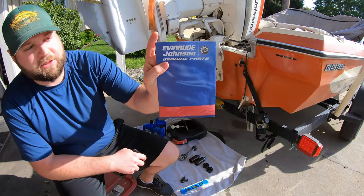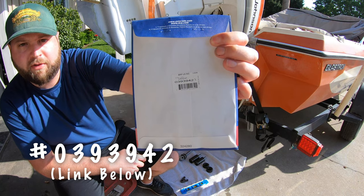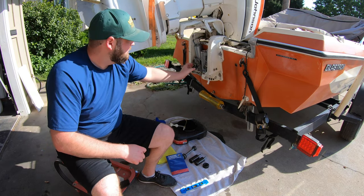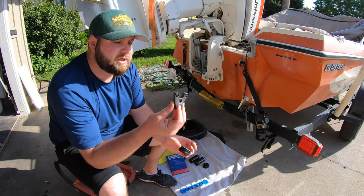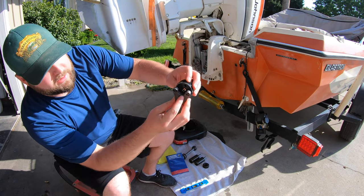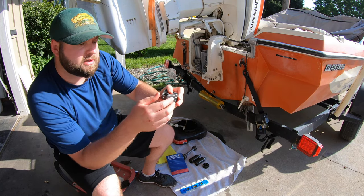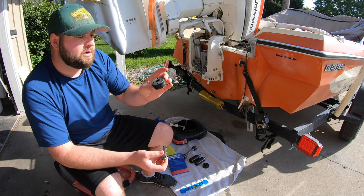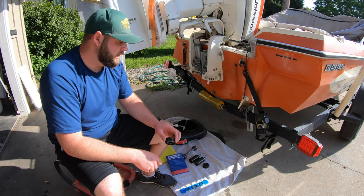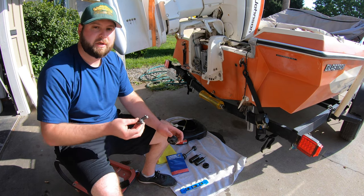This is the kit right here — it's a genuine Evinrude Johnson gasket kit. Here's the part number if you're looking for that one. If you're wondering how to get these little caps off, there's actually a special tool — I'll leave the link for that below as well. It basically fits three little prongs and fits right in there, and you take a breaker bar or a ratchet and you can turn it. A few good turns and you should be able to get the rest by hand, as long as it's not all corroded or rusted over. So this tool is specific to it, and if you plan on replacing these trim tilt seals, you'll need one of these.